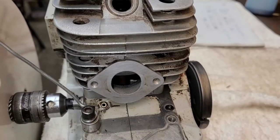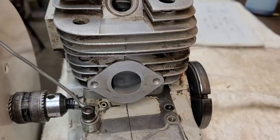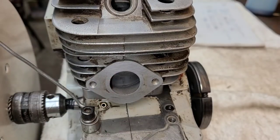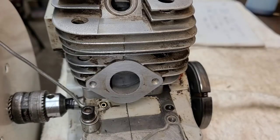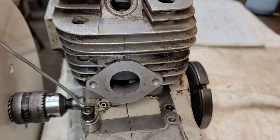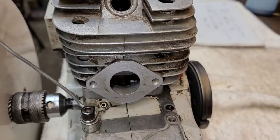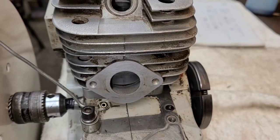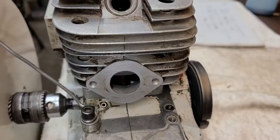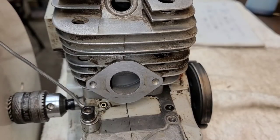That little noise is the runout in my timing wheel rubbing the feeler. At 152 degrees, I'm going to add about a degree — which means I'm not even really going to measure it. I'm just going to clean up the bottom and do a little go-fast work to the intake. I don't want this intake open too long, and I also just want to make a good work saw that's easy to tune and doesn't use too much fuel. The intake timing is already pretty good on this saw — some saws already have aggressive intake. Our biggest problem on this saw was the exhaust roof.